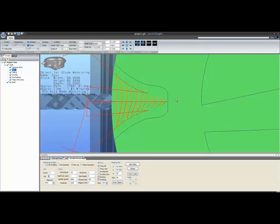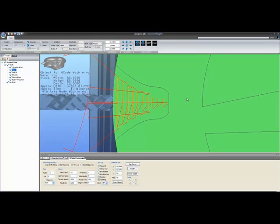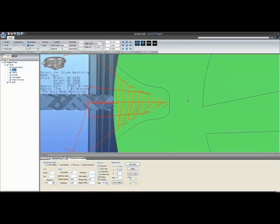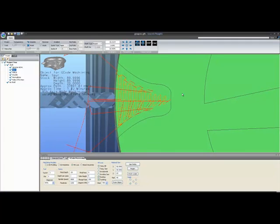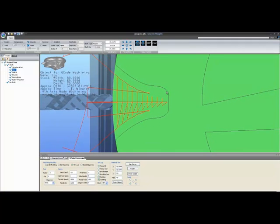profile of the tooth because that'll allow us to do epicycloidics as well as spur and timing gears and so on and so forth. Because of that, you have to be very careful that the toolpath you're cutting is appropriate for you. And in this case, when I had a 4mm tool, we were getting down to the root, but it was clipping on this curved trochoidal portion of the root, and since it has been instructed to never cut material which is inside the gear, it simply would not go down to the bottom and do it.